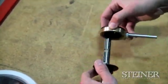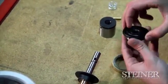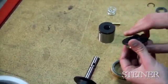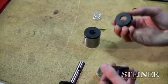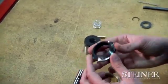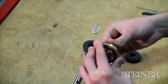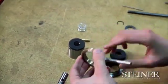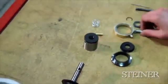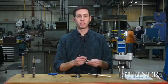This clutch will look a little bit different than the ones you've seen. It has a couple more parts to it. So starting from the shank end of the tool, you'll notice we have a bearing pack. That bearing pack, you have our part here, and then this part of the activator. It's called a drum retainer. This drum retainer is to hold our bearing surface on there. It's all supposed to slide. Here's our friction ring. This is our bearing surface. You'll notice on here as well that there's a grease fitting. Consult your operating instructions as to how often you should be greasing the tool.